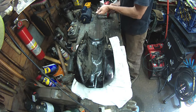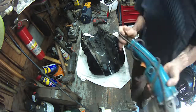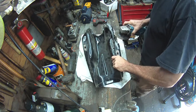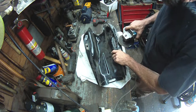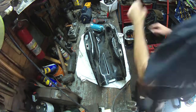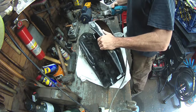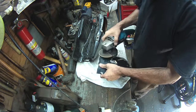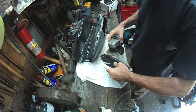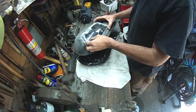The game plan here is to drill a hole — I believe it was a quarter inch hole, maybe three-sixteenths. And then I'm going to take a center punch that is tapered and enlarge the hole with the taper of the center punch. What that tells me is that gives me more material for the solder to stick to. If I were to drill a perfectly sized hole for those brass fittings to slip in, you're soldering into essentially the edge of the tank. But by tapping the hole larger, I've created a velocity stack type shape in the tank — that gives me more surface for that nip to fit into, as well as the solder to stick to. And spoiler alert — it worked out quite well.